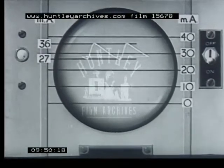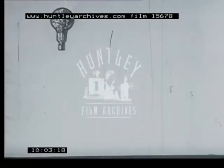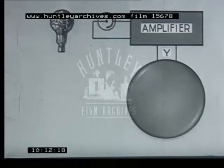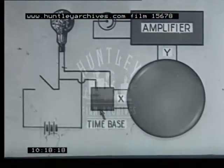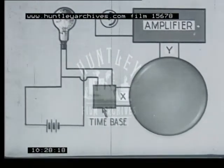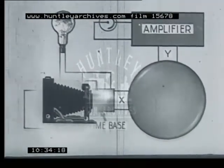Although recurrent phenomena give the most easily studied picture, the cathode ray tube is equally useful for purposes where the phenomenon only happens once. For example, we may wish to study the light output from a flash valve — how long does it last, and when is it at its brightest? We arrange a photoelectric cell and amplifier to apply a voltage to the Y-plates of a cathode ray tube proportional to the light flux. The flash may be ignited and the time base triggered by the same switch. As you see, the trace is gone before you can study it. So we'll rig up a camera to photograph the tube face and obtain a permanent record.